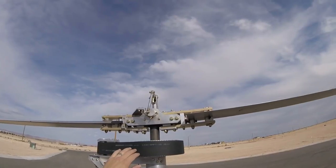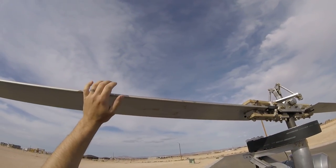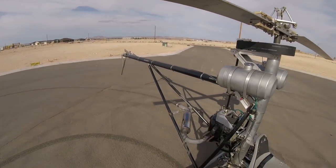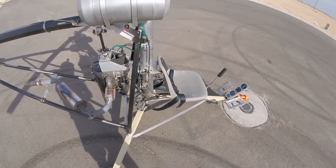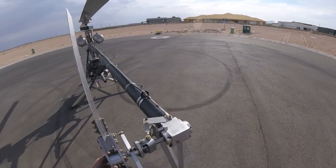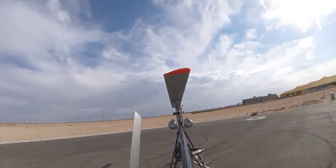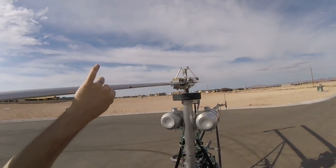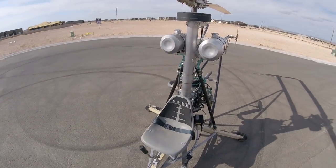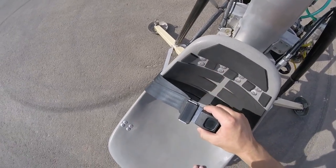Yeah, so I re-greased the head and I can see that it's slinging out everywhere, which is fine. I kind of just want to look over everything. Shut the engine off with the rotor still up to feel for tail rotor vibrations, and it feels good. No complaints there. I did a little mini auto, so I put the collective full down, and the rotor stayed in the green. So that's a huge plus right there. I was looking for that.